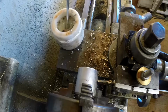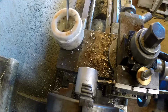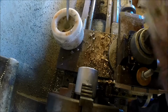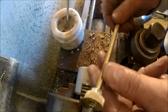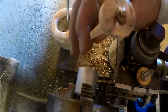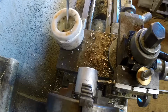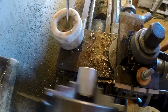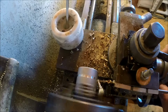Okay, we have the threaded brass pieces done. I'll stick one under the camera before we do the machining. I mean, they're not done. What we've done is we've machined them, and now there's nuts just to hold it. We got it locked tight, so we're going to face everything off, and that's the reason why I'm using the brass shafts. Now, these aluminum pieces are going to be for the back knobs to hold it. I'm going to drill and tap them using like a cam lock.